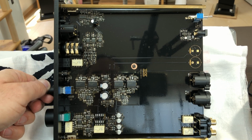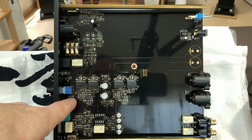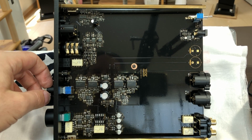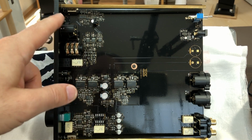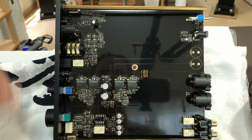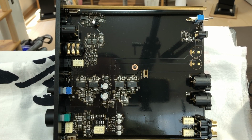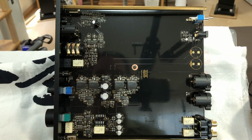There's also the gain stages connected in directly here. I guess these could be the gain resistors connected to gain, and of course this could well be single-ended as well, which probably says much about what's going on. Then this output goes to balanced or single-ended, but that's kind of how the THX seems to work. And of course, one part of this will be the feed-forward circuit. I'm not quite sure which is the negative feedback circuit. It could be this one, or it could be part of this built in here. Apologies that I don't know in detail.